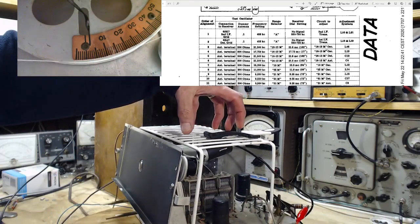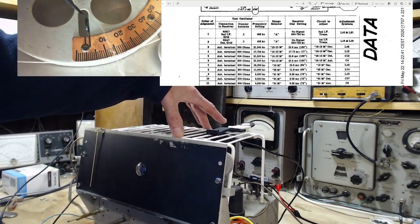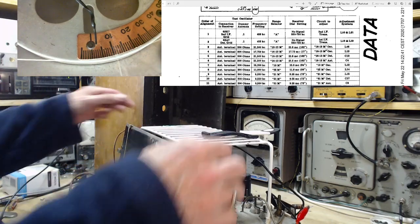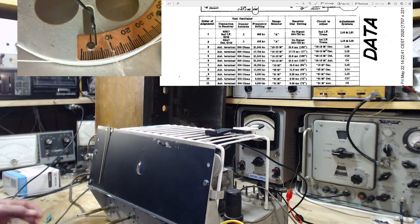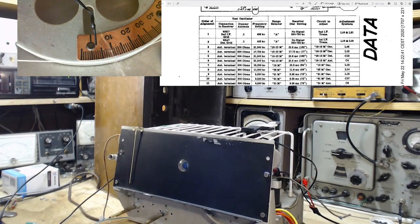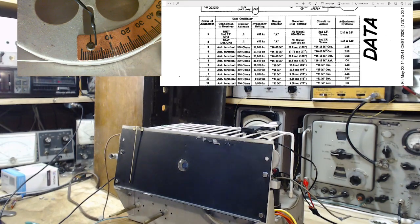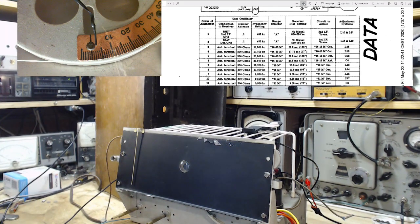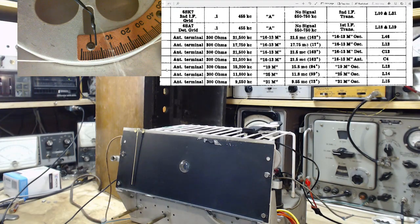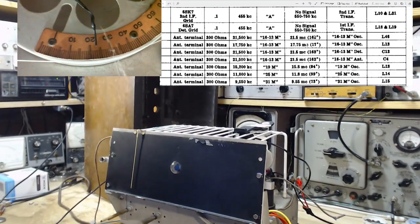Because I have the camera attached to the radio chassis, essentially I can swing it around here, and the camera angle against the back here doesn't change, but I better not move this. A little bit of parallax won't hurt. This band anyway, it's not that precise. Now, if we look at the instructions, I'm going to zoom up a little bit here. Okay. 21,500, 162 degrees. So this is where we need to dial the radio to 162.